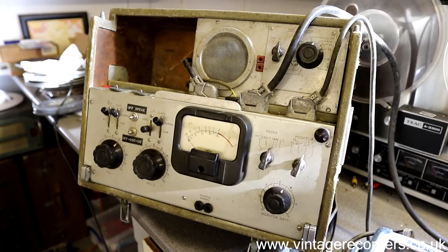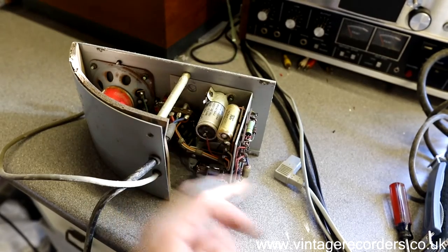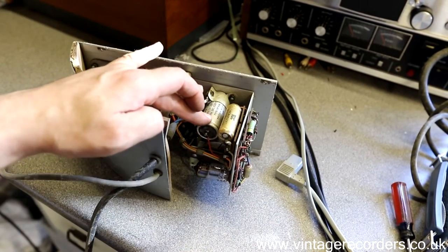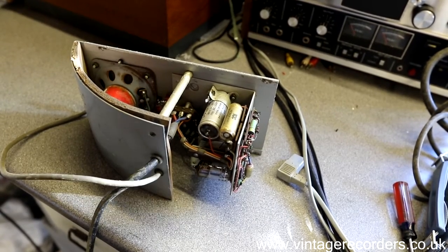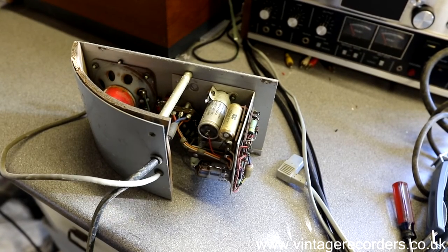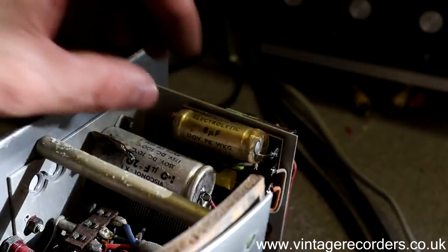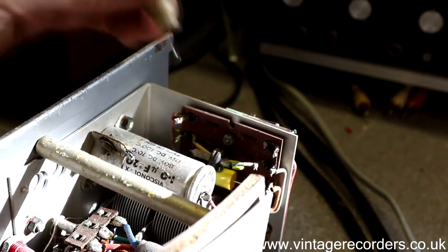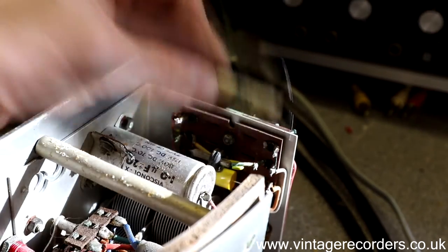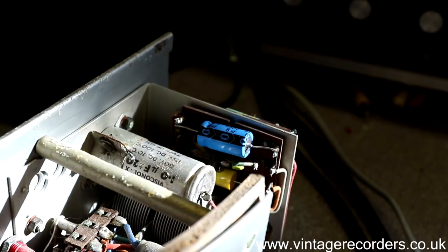So replacing a handful of capacitors in the power supply — I haven't bothered to check which one's faulty, but I know at least one or more of those was actually faulty. The next step will be to open up the amplifier and do the same treatment of replacing all the non-electrolytic capacitors. So here is the oscillator. There are three capacitors on this one that need to be replaced. The electrolytics are usually okay — it's not a rule of thumb that they're always okay, but usually. Once the non-electrolytics have been replaced, if you're still having problems, then that's the time to do the proper fault-finding. However, this 8 uF electrolytic is by the same company as the known ones I'm having issues with, so out of precaution I'm going to replace that with a modern electrolytic.